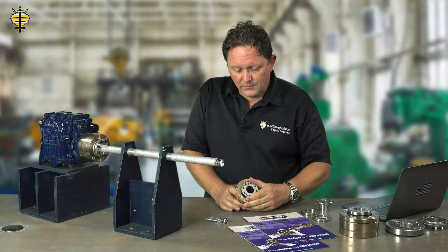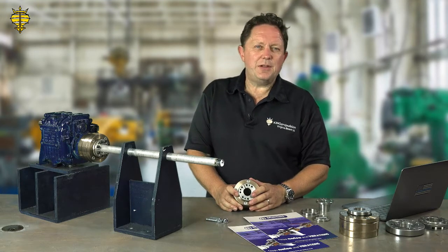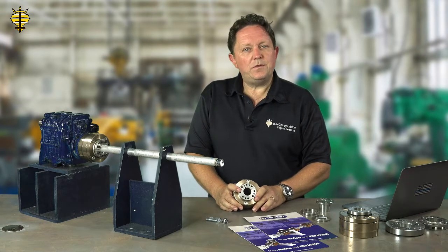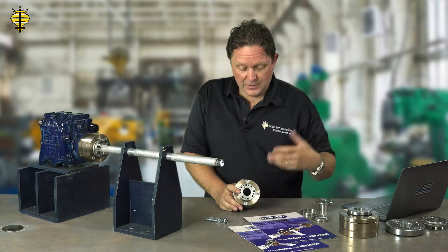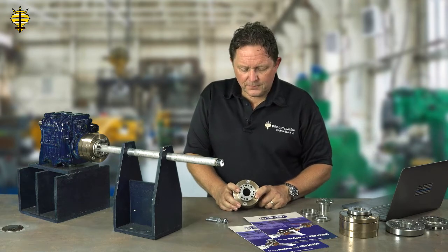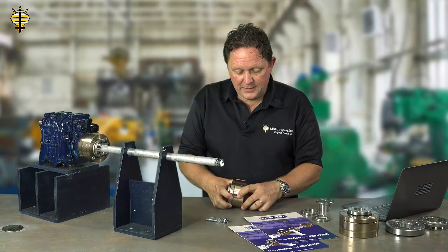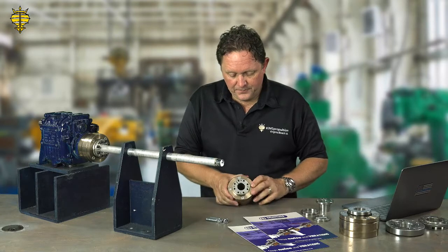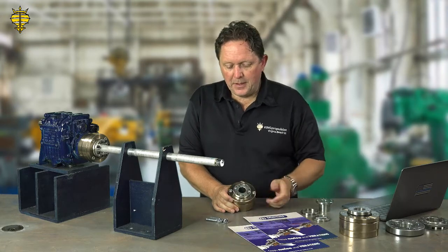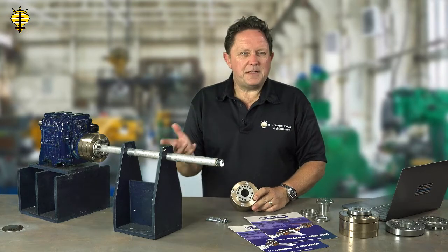The working life — for small vessels these go to about 75 horsepower, so you're looking at about 35, 40, 45-foot boats. You're looking at about 12 to 15 years. It is a wearing part, so they will have different lifespans depending on how hard you load them, how much you work them, and how much of an offset you put on them. But in general, they're designed to be very, very low maintenance. They're pre-filled with grease, and pretty much every time you do a major haul-out — every five years or so — you can take them apart and re-grease them. But it's a sealed system, not designed to be maintained, kind of like sealed batteries.